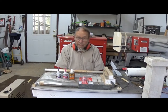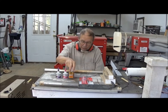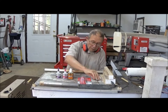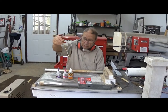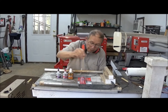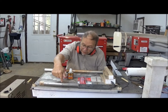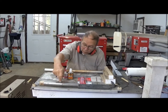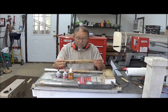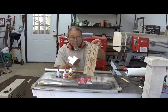We have completed our adventures with knife-making adhesives. We used two varieties of super glue, Gorilla Glue, and Shoe Goo to stick this together. We also used some mechanical elements — a brass rod, 3/16ths inch, used here to mechanically restrain the blade, and a nail on the other side that goes through here to hold the tubing to the wood core. The wood itself is tea olive from the same tree that Billy Joe clung onto for dear life during a hurricane in Louisiana, and some of it is spalted and quite colorful.